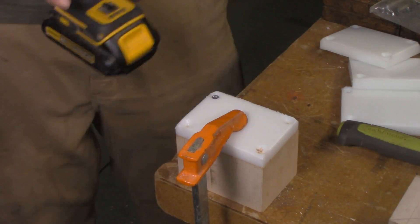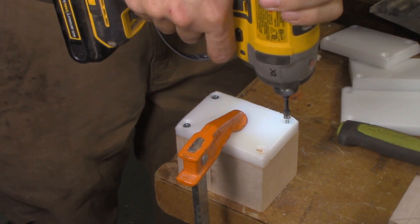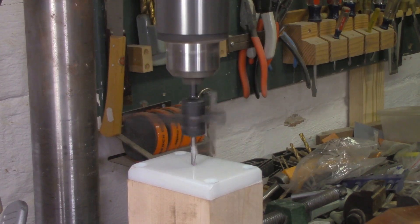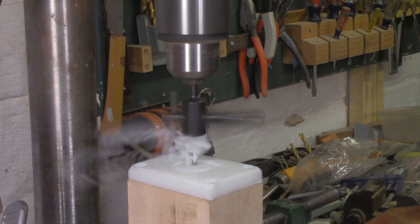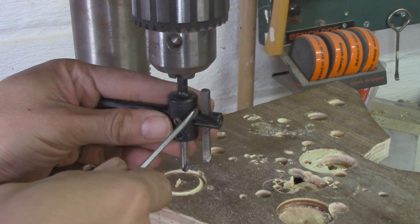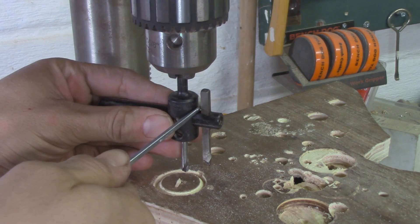Polyethylene is a durable material, and it's also slick like Teflon, so it's going to have a very smooth glide to it once it's done. To get the holes the exact right size, I used a circle cutter in the drill press. This is a cheap and effective tool that you should get if you don't have it already — I'll link to one in the description. What I like about circle cutters is that they're extremely easy to adjust to a very precise diameter.